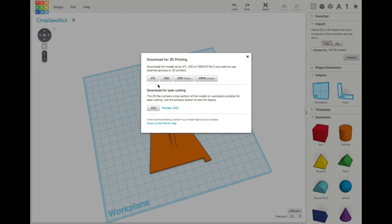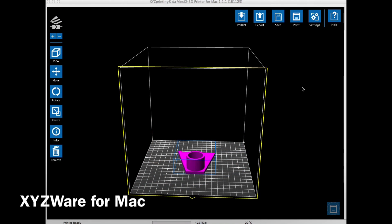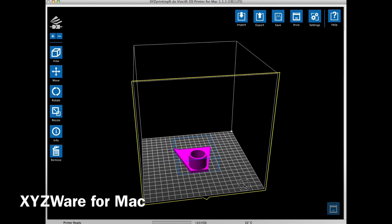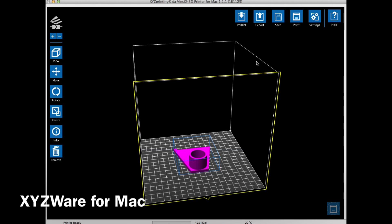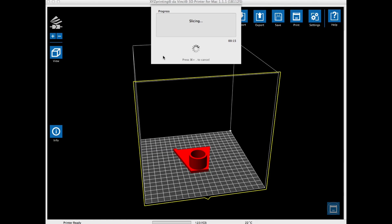I downloaded it for 3D printing as a .stl file and imported it into XYZware. I loaded the .stl file into XYZware from Mac and did a quick look around. It looked pretty good — I didn't see any gaps, holes, or anything the slicer might have a problem with. So I chose large 50% fill, a 0.4 layer height, thick shells, and a fast speed, so this thing would print pretty quick.